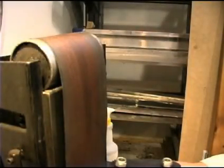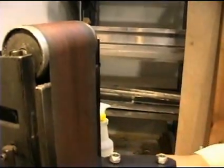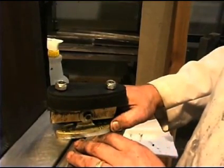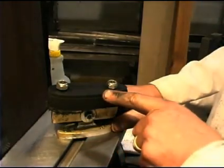Finish polishing with a 220 grit wet belt. This step will help achieve the smoothest possible surface of the rubber and the plate. Slow going is good. Make sure not to undercut the scribe line.